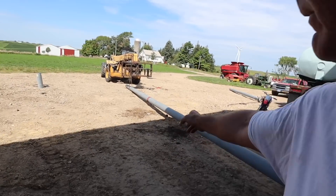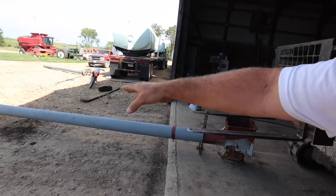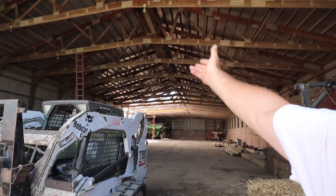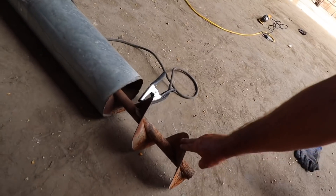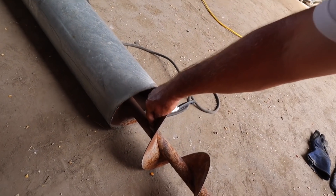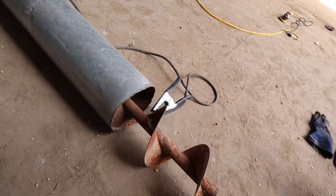Me and Cooper, we're going to bring this auger in. We're going to be making a different system in our big machine shed to move corn from one end to the other. Just kind of follow along and we'll show you as we go what we're doing — I don't even know what we're doing, but we're going to try it. This flighting on this tube, we got to cut it back here, so he's going to weld a bead in here so when we cut this off, it don't unwind.